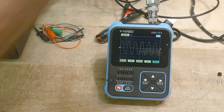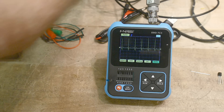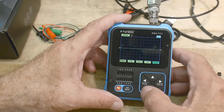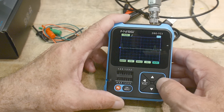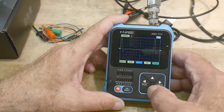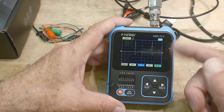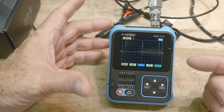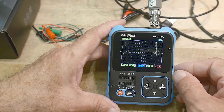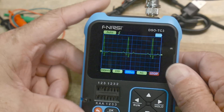Let's put in some strange waveforms. Let's try this one and see if it can auto-tune it. They usually have problems with these types of signals — and yeah, it kind of struggled here. But we can dial it in ourselves. It's having a little difficulty synchronizing, and I couldn't find a trigger level adjustment. So we just halt it, and there we go — a nice display of an EKG waveform. Pretty nice.